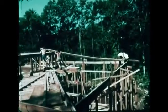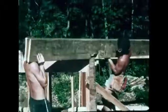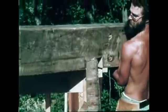There are different types of rafters and different style roofs. This house has a hip roof, which besides common rafters, also has hip rafters. Hip rafters run down to a corner formed by two exterior walls. This long hip rafter is 3 2x12s nailed and glued together.